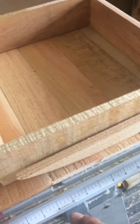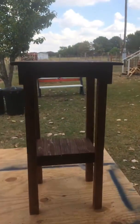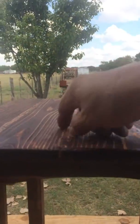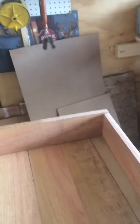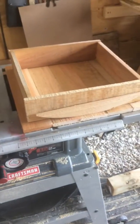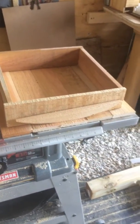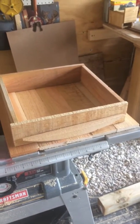And also remember, when you're putting things together, if you're making a duplicate table, to match the existing lines, like this angle here is perpendicular to the top. So I've got to make sure when I do that over here that it is going to be perpendicular to the wood running this way against that way. So that's what I'm going to do. I'm going to staple this little box together and glue it, and then I'm going to cut it with my jigsaw. I'll be back.